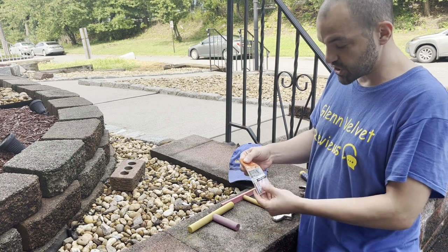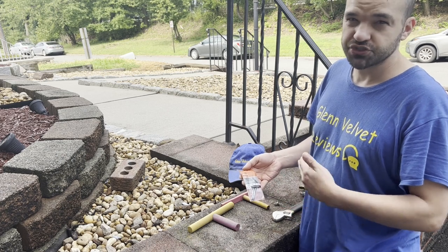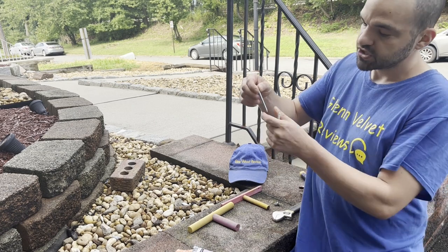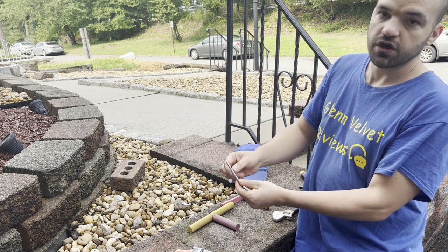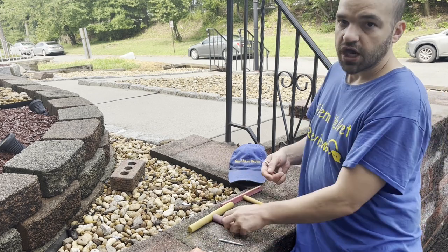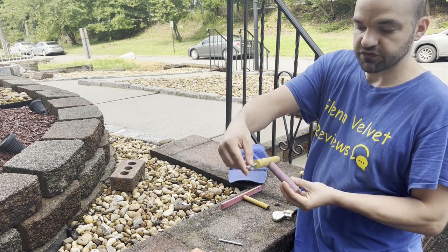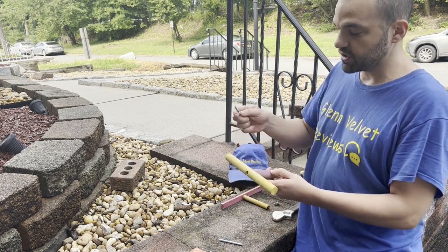These are how I'm going to connect these inside his cage. I'm using these hanger bolts — they call these dowel bolts, hanger bolts, different kinds of names. This is what they look like. You could probably get different ones better suited for your application. See how this has a long neck, so you might have to go in a little bit deeper because of this long neck, just to make sure when you have the washers on that it works properly. I got quarter inch because this piece is only about three-quarter inch or seven-eighths or something like that in size.